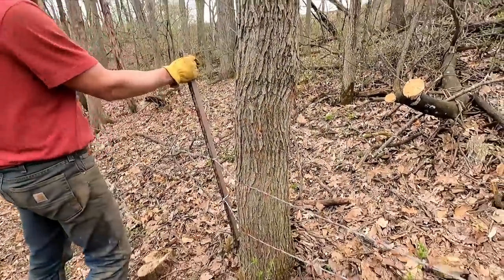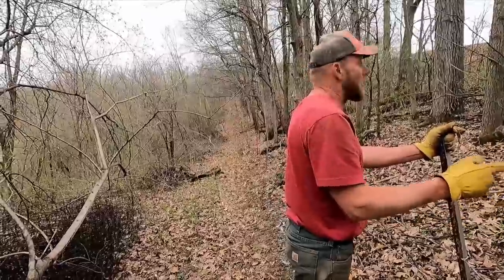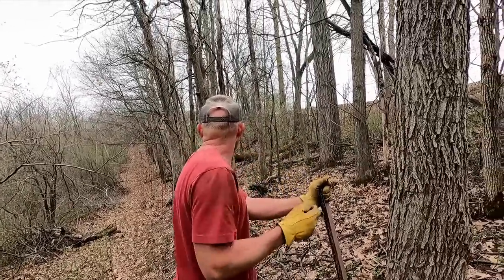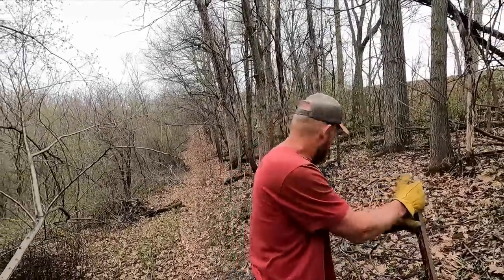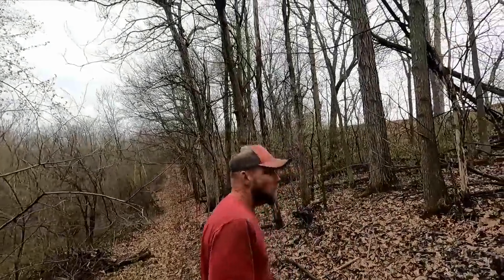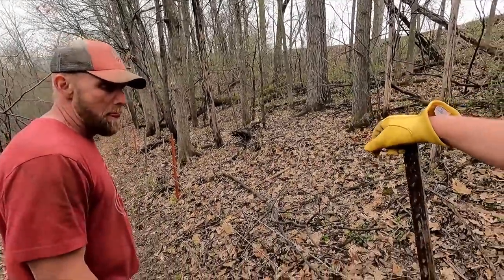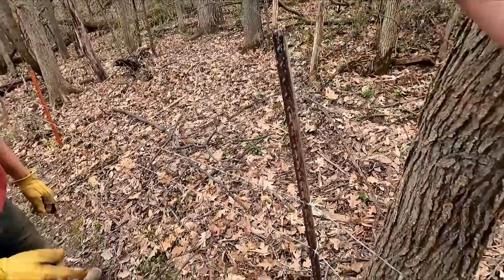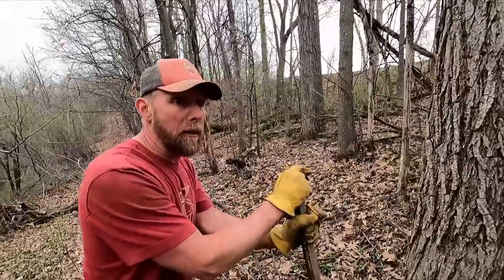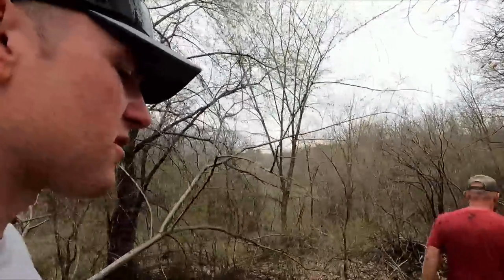This guy's still in there, but it's an elm tree so I don't put nails into a nice oak or walnut, but we're using it as a brace. Because of the terrain we can only go about 150 feet and then we have to stop and tie it to something, because we've got places where the wire is 100 feet in the air and the next place it's on the ground. We dipped into the woods here after getting that line straight up top. Dad wanted to show what we're doing down in here — using some of the old posts, getting them upright. There's a windrow of trees where the posts are growing right in, the roots kind of consuming them.